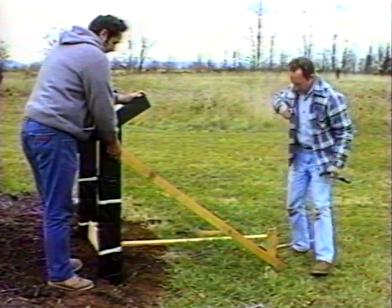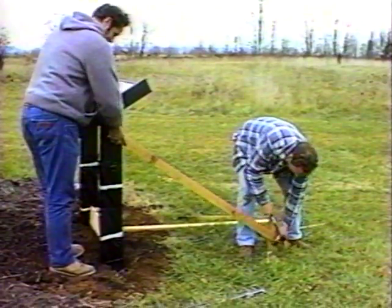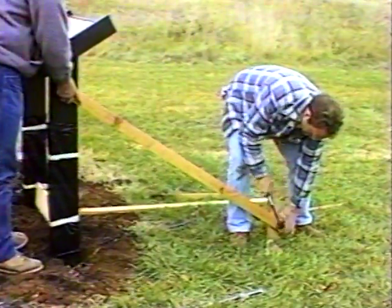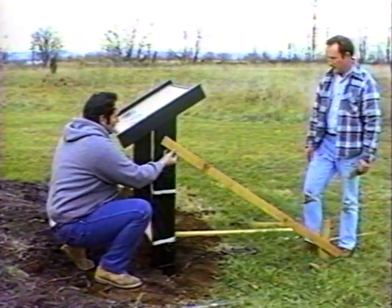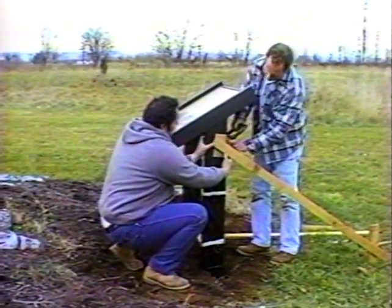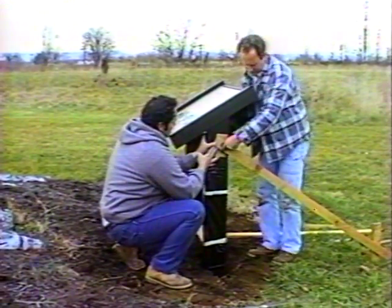Next, take a brace about 6 feet long and nail it to the stake, while a second person holds the opposite end against the top of the leg. Using a C-clamp, fasten the brace to the leg. A clamp block protects the paint on the opposite side of the leg.